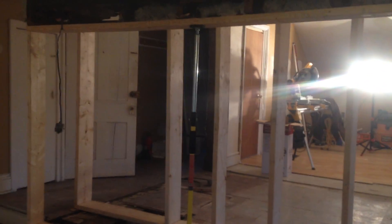Also here, it didn't come out far enough, so I had to put a ledger board on and bring out the lip just a bit. So now it's fully framed in. We've got our king studs on right here, there's our bottom plate along there, another king stud, and then there's a top plate. That's just going to help for levelness and just makes it look a little cleaner.